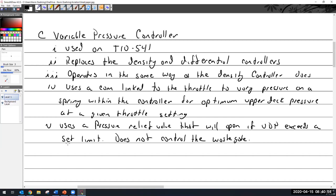Well, at a certain altitude, the air is going to be so thin that the engine's only going to suck so much air. So wouldn't that basically limit it because the density of the air is so thin? Yeah, that's what I'm saying. That and the size of the turbo is planned in there that way. You can't just go buy a bigger turbo and bolt it on this thing because the controllers weren't designed to work with it. Okay. And then you would probably overboost and overheat and all these other bad things would come into play.